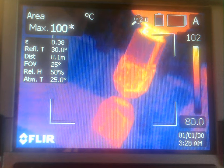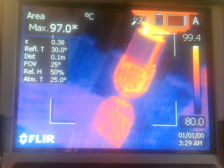This is test number three of 1.6 millimeter diameter copper wire being deposited at 30,000 RPM onto a 99% medium polished aluminum nitride substrate. We are traveling at a surface speed of 75 millimeters per minute with an XZ feed ratio of 80, which means we're traveling a total of 10 millimeters on the surface.